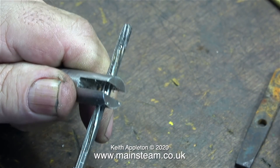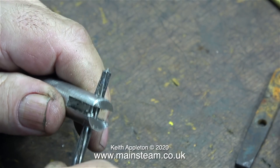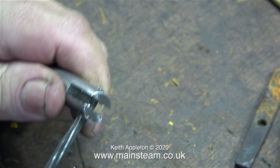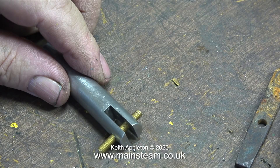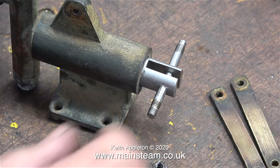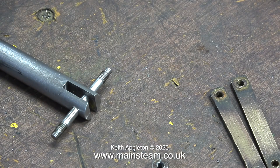The diameter of the hole that I drilled in the ram is one imperial size under 3/16 of an inch. Here I'm reaming the hole in the end of the ram using a reamer which is 3/16 of an inch in diameter. I've temporarily fitted what's left of a 2BA bolt — it's a great fit, no slop at all. But I'm not going to use a bolt; I'm going to make a stainless steel stud, a bit like this but shorter. The first part of this job is successful — this ram is so good it would work without any packing in it at all. In the next episode I will show how I groove this part for the O-ring, I'll be making a proper stud and a completely new handle.